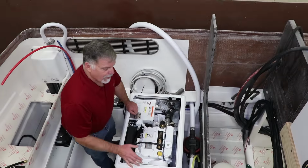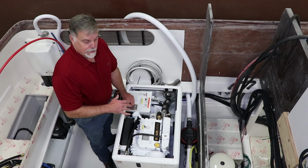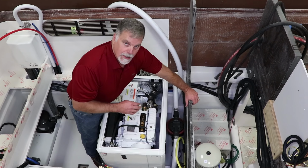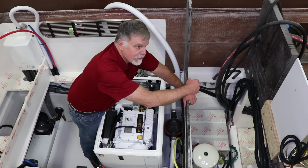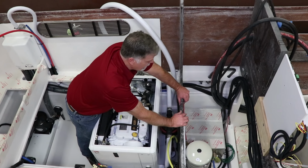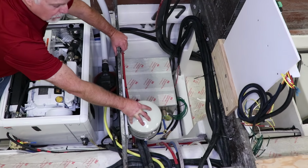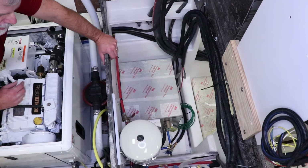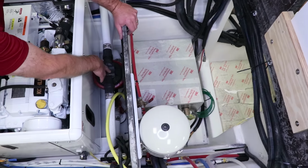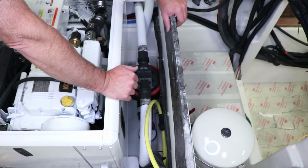Yes. So here we are, and in the finished boat, I'll have come down into what we call the port lazarette. And all of this is actually a kind of closet space that's part of that quarter berth area. You can see the 11-gallon stainless steel hot water heater here. This is a pressure accumulator, so the water is very smooth when it flows out and you don't have any chattering in the plumbing. This is a super heavy duty, oversized macerator pump that lets you, when you're offshore, pump out your tank.